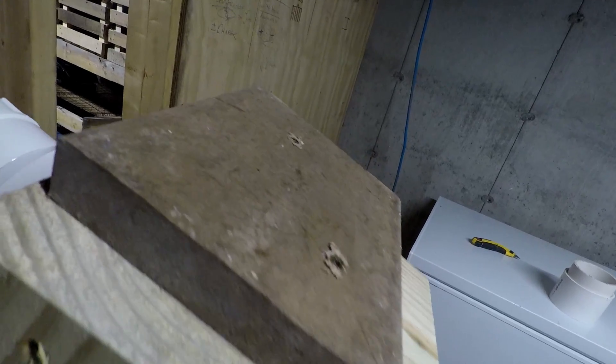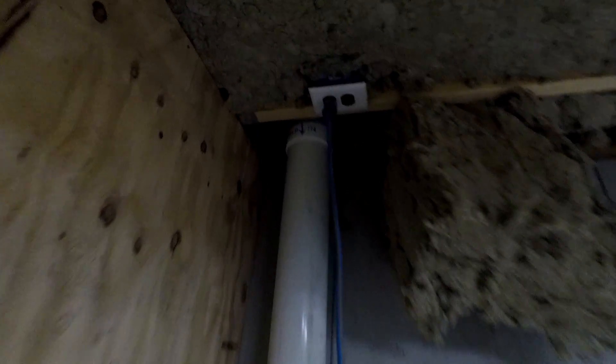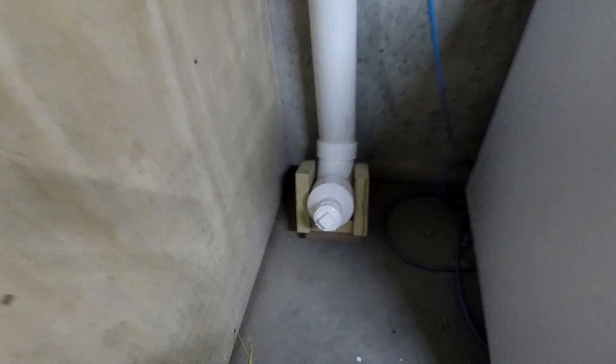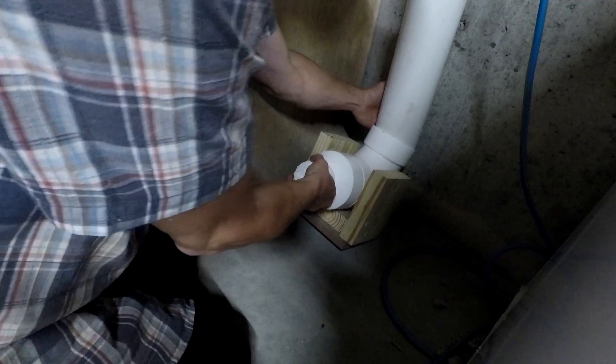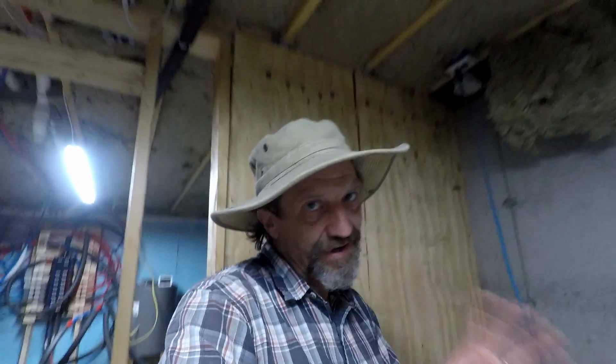It's fully seated and it's ready for the down pipe, which I haven't measured or cut yet. So I made this boot — it's pressure treated with some composite decking scrap. This will come here, and then we just have to measure the distance between the two pipe openings. I cut the pipe and it's gonna be a tight fit. That's snug. I'll explain the controls — very low-tech, very simple controls. This is the three-part system.